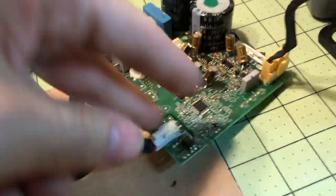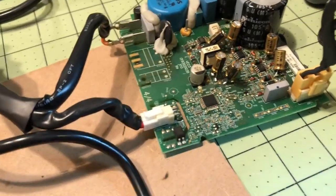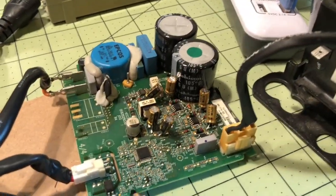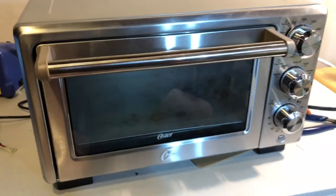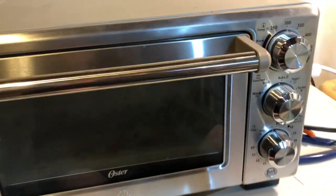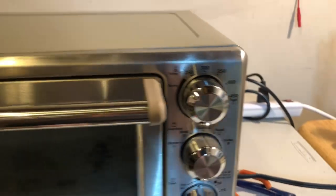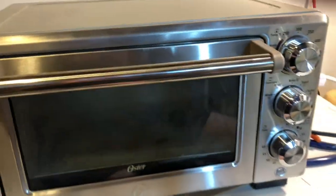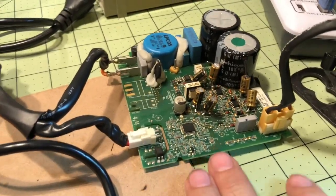Now this is not a general field repair — this is just a repair that I did to prove that yes, they can be repaired. And how I solved that issue was I used an oven and set it to warm, about 200 degrees, for 30 minutes. That was able to warm that compound up so that I could take it apart safely.